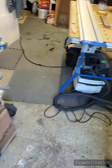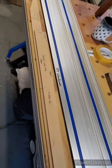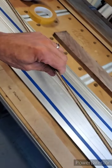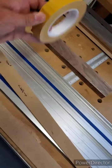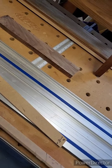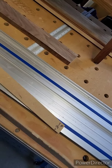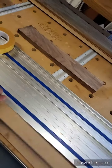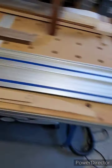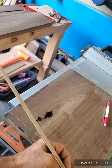When I had done the console table, I also made templates for the legs, and what I found is when I made them out of quarter-inch MDF and double-sided taped them to the piece, when I tried to get them off, the templates tend to break. I don't know if the tape is too sticky or I'm doing something wrong, but I've decided to make all the templates out of quarter-inch plywood, so we'll see how that goes.